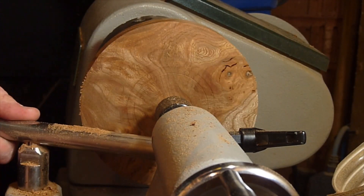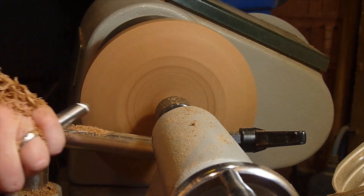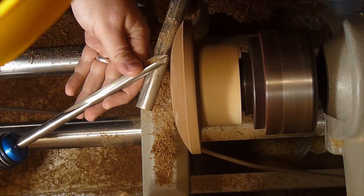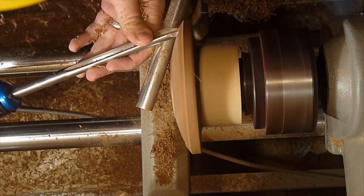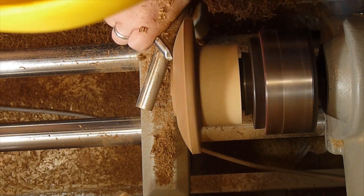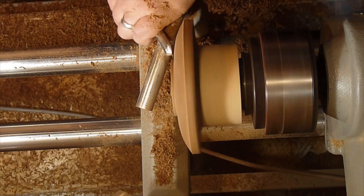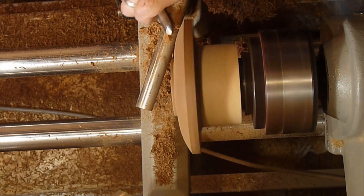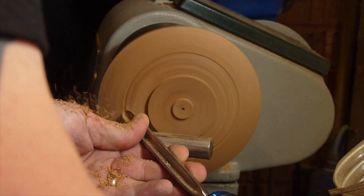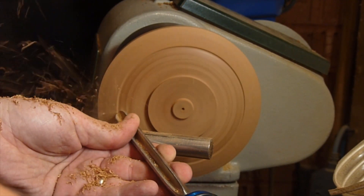You can see the mark where I used my calipers to set the width of the tenon. I'm now taking the bottom of it round and giving it a nice shape — just creating that tenon with a couple of push cuts. You can see it coming in there now. With the C jaws on the SK114 chuck, you only need a minimum of 5mm chucking point for a tenon, because there's a tooth just inside that really grips on, so as long as you've got it cut accurately...